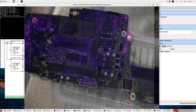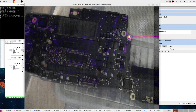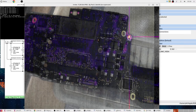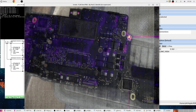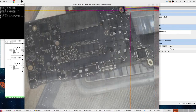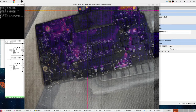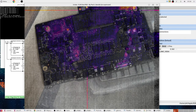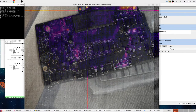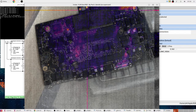I really cannot see anything. I'm pretty sure, 20 milliamps, 20 volts, it's 400 milliwatts. It's not an insignificant amount of heat, I should note, though, because if you get a single cap or something like that that is shorted, down to about 100 milliwatts, it will pick it up. But when it's just arbitrarily distributed across the board, then it's quite difficult to find it.